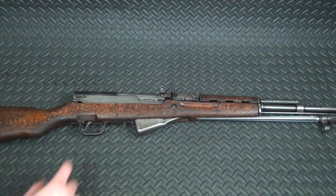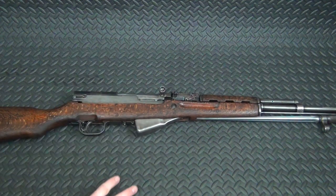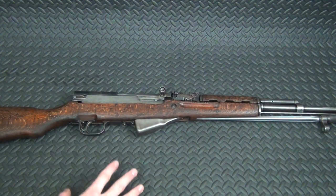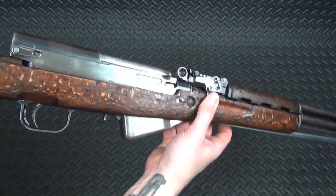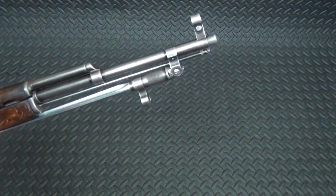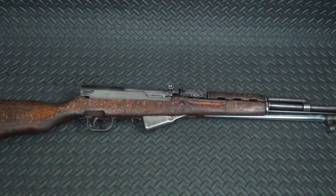Other than the cosmoline removal, I did have to put a light coating of blue on the receiver and on the magazine — they were bare metal with nothing on them and I didn't want to worry about rusting. So I put a light coat of blue on there to get it to that same gunmetal gray as the barrel and everything else has faded to.